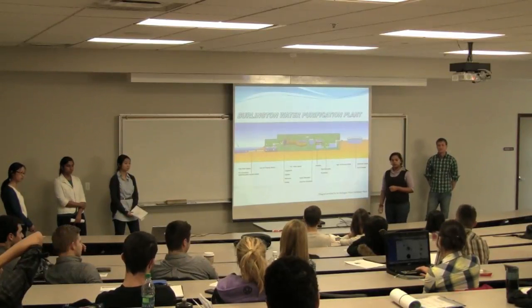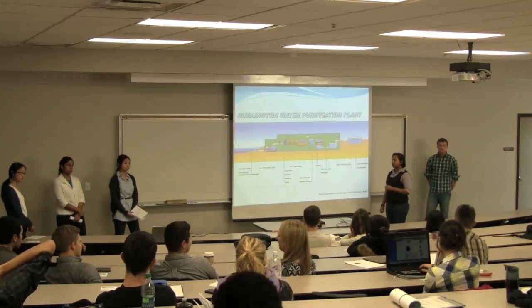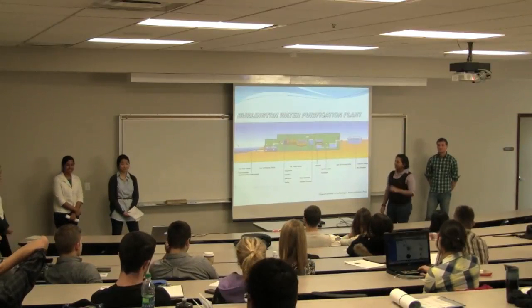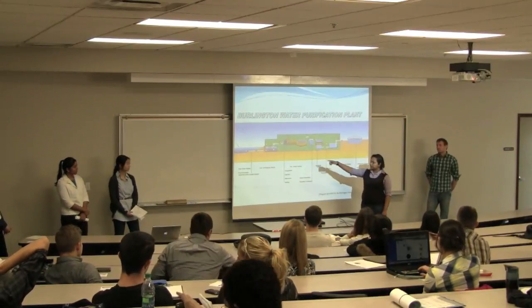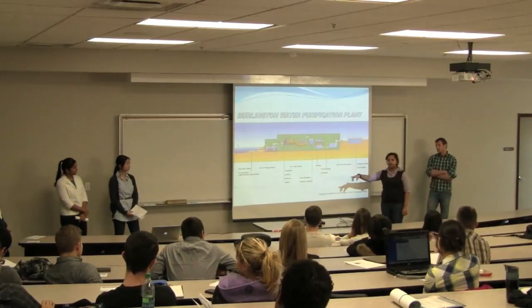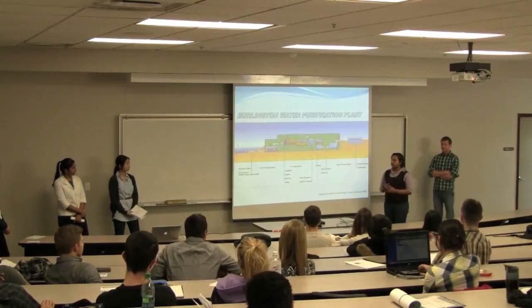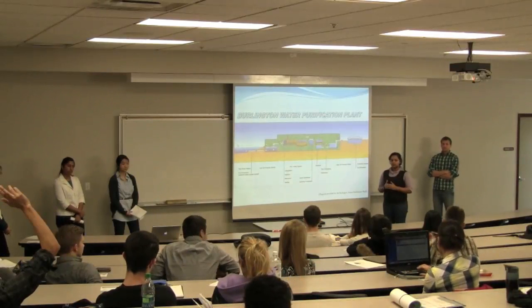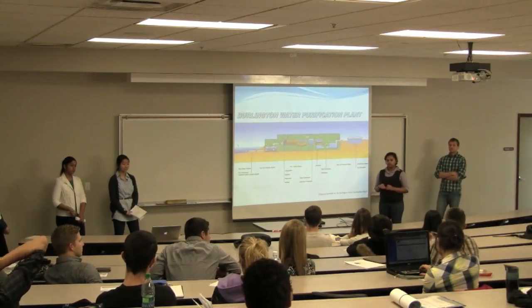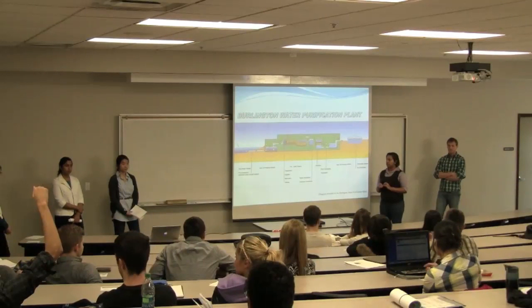What's the time delay between making that increase in the load of the pumping station and actually seeing the change in the distribution tank? I know the tanks before it's put into the active flow system have a residence time of 30 to 40 minutes depending on the season. I'm not sure of the time delay. Yeah, because obviously with process control, we know that time delay and long residence times are two things that really kill us. We have to be really tuned on control. So I'm just curious what that is.